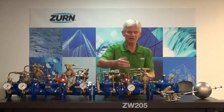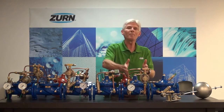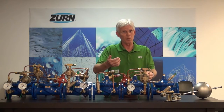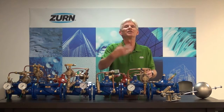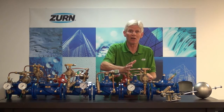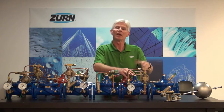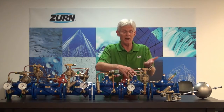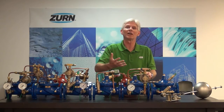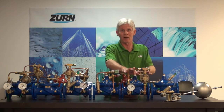The next valve is the ZW205. This valve serves as a relief valve or also as a pressure sustaining valve. When mounted in a branch line on the T of a main line, it will serve as a relief valve — if we go over pressure, this relief valve will open up and dump that excess pressure to atmosphere, pump suction, or maybe even to a tank. When mounted in line, it serves as a sustaining valve, always holding back inlet pressure. As long as inlet pressure is above the set point, the valve remains open and allows flow downstream. But if inlet pressure starts to drop, the valve will begin to pinch itself back, even going fully closed, so that we always hold back a certain amount of inlet pressure.